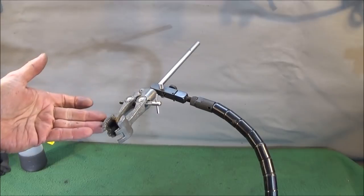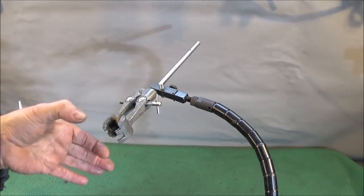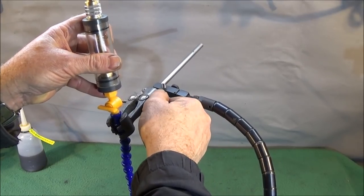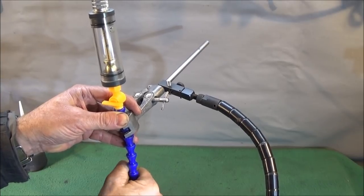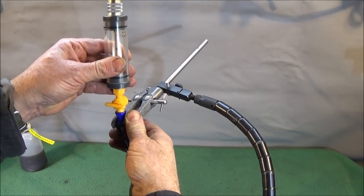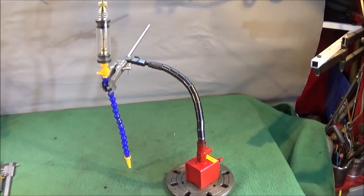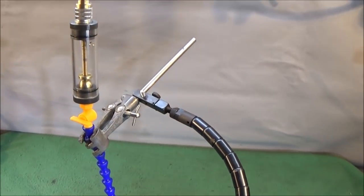On the DTI stand I have this test tube holder — it's a nice aluminium one. I've left the stem long so I can move it in and out, and it's got good adjustment all round. The plastic piping goes in between the forked end — just nip that up. You can position the lower part of the pipe on the ball joints, and if you leave one ball joint above the test tube holder you can use that to keep the cylinder part in the upright position.